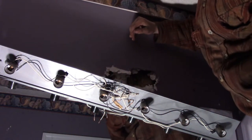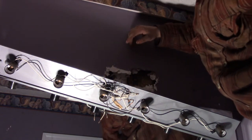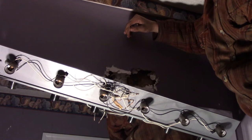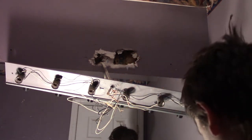The only issue is whether my light is going to cover up this hole — if not, we're putting the old light back up. As you can see, there's an enormous hole up there. We are going to have to put a box in because the new light has two holes which hold it to something, and in this case you have to have a box.